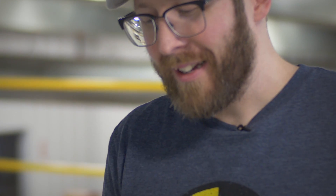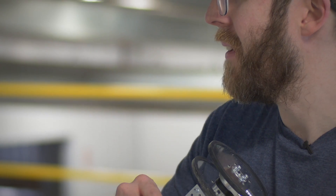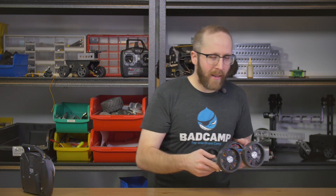Here's what we think we learned: the underbelly magnets are more reliable once you get up onto that flat surface, while magnets in the wheels would have worked really well on a curved surface. Up on the girder, maybe we could have had one or two more levels of the underbelly magnets. Probably that, plus acetal wheels instead of acrylic — though the wheels cracking does act as a shock absorber so that force isn't transferred into the motor shaft. But we can't stop there — we have to actually make something that drives around without falling. So just before the end of the day, I came in and made some modifications, and we're going to go through and test that out.